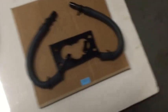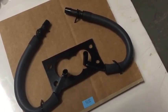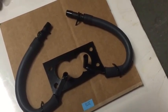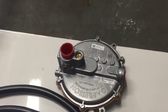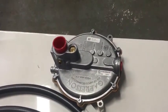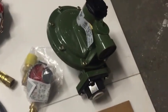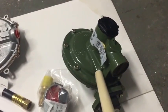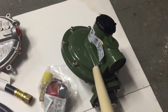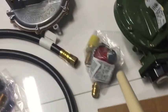Let's do a quick overview of all the parts that came in the kit. First, we have the motor snorkel itself — it goes between the carburetor and the air cleaner and replaces the gasket. That's a pretty quick, straightforward install; on my other generator it took me maybe 10 minutes. The hardest part was mounting the regulator. This thing has to be mounted and plumbs into the motor snorkel. Since this is a 22-horsepower engine, I needed a different flow valve — I talked with the folks at US Carb and they explained that with the 22HP engine you need this flow valve along with this one.